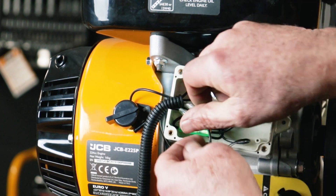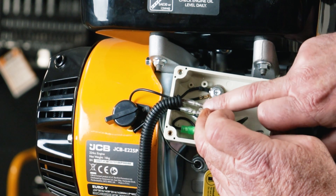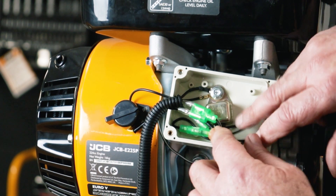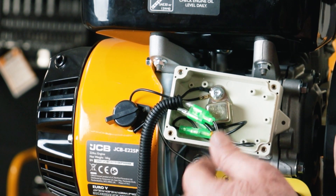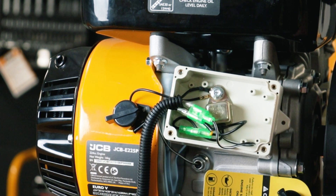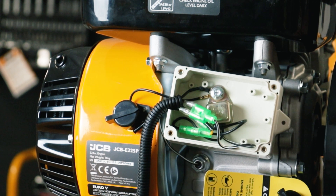We're making sure that all the little insulators are in place and insulating all the connections. For example, if that metal were touching on the diode, that would be enough to ground out the spark pack and stop the spark. So all I did was open up the box and had a quick inspection to make sure all the little plastic insulators are in place. On the same note, check that nothing is disconnected — if something were disconnected, the on-off switch might not work or pushing the emergency stop wouldn't stop the engine. These are things we need to check when we first start operating the machine.